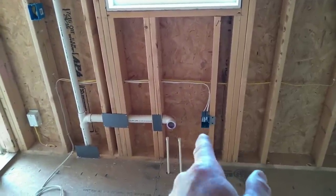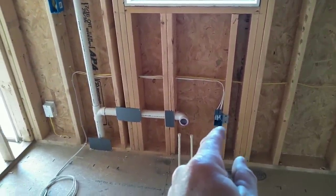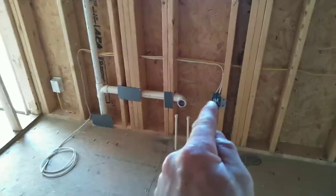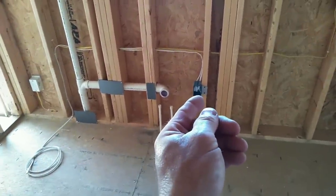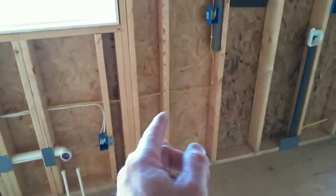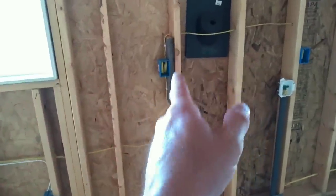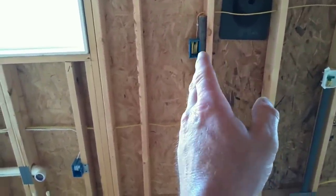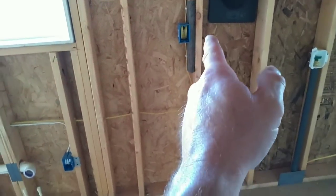This is an adjustable box underneath the kitchen sink, in case I have to isolate the GFI from the arc fault. In the past I've had three dishwashers where I had to separate the arc fault and GFI. You can also add a food disposal later if you choose. This outlet here will be within 24 inches — you see the block there that makes me compliant, because without it I was at 25 and a half inches.